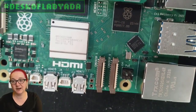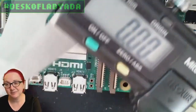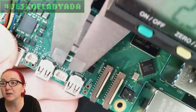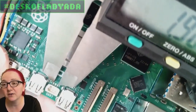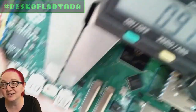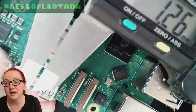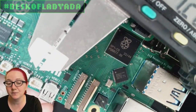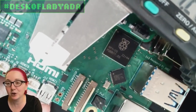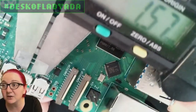So the first thing we want to do is find out the connector pitch. Most connectors are in millimeter pitch — not always, big ones aren't, but small ones tend to be. So what we want to do is measure between the centers of the two farthest pins. You might wonder why not measure two pins close to each other — the reason is the difference in pitches can be really small, like is it 0.91 or 1.25? You want to average the error over a larger number of pins so that if you have error, it divides out.